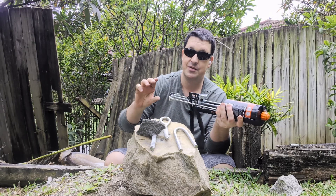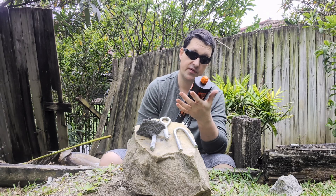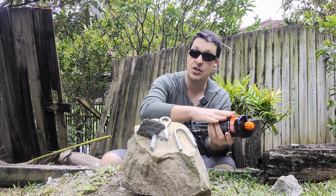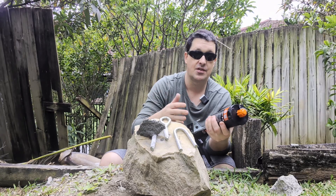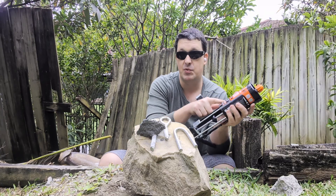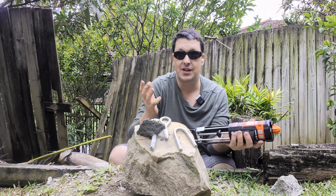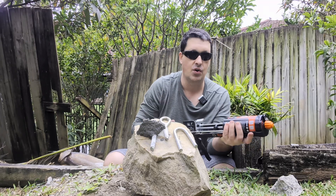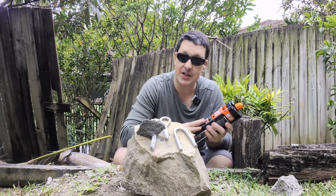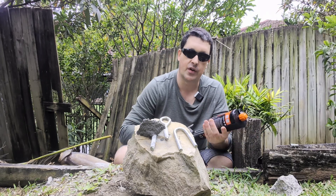If I'm going to be using a polyester glue, I want it to fit into a regular size caulking gun — one of the small ones, not a big thing like this. Also the cost: this was $32 for 380 millilitres. I can get an epoxy which is stronger and sets slower for about the same price per millilitre, so you don't even really have a price advantage. That said, I'm sure there's going to be plenty of use for this — the marine grade with a 100-year service life is going to be really attractive to most Australians who live on the coast. For climbing bolts, in my opinion, nothing to get too excited about, but it is really good to see innovation and improvements happening in the chemistry of these things.